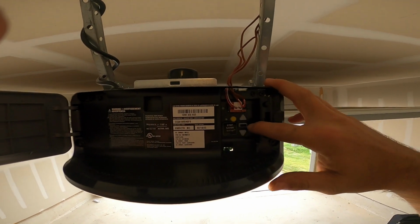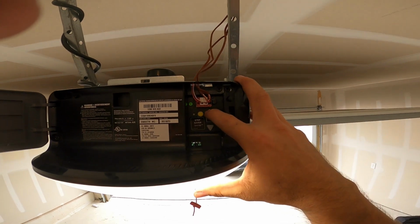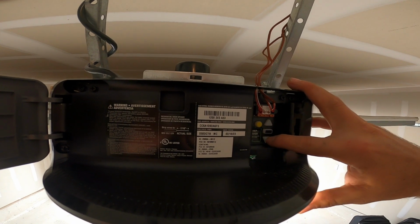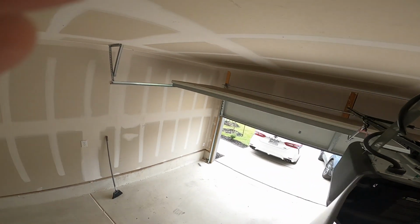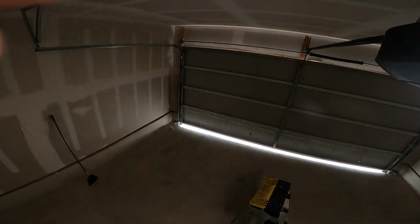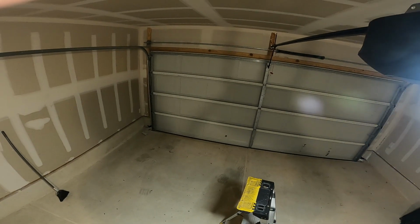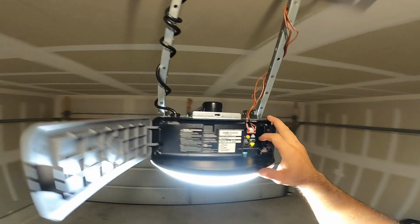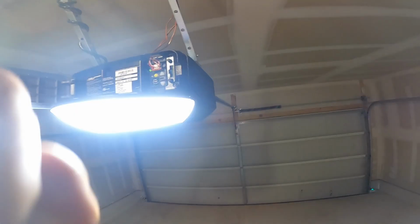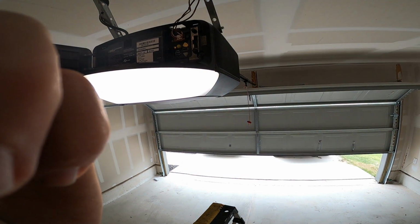All right, so in case you guys missed it in other videos, we'll walk through this one too. So to program the motor, you hit the black button, it'll beep. Up arrow flashes, you toggle it where you want it. So it's pretty much set where I want it, so I'm gonna hit the black button. Now the down arrow flashes, I toggle the down until I'm happy where the motor's at. Keep holding it down until the motor gets where you want it. Nice and snug, but not too tight. Definitely no light showing. That's good. When you're happy with it, hit the black button. It'll start beeping and then it'll run the force by itself. It'll go up and down.